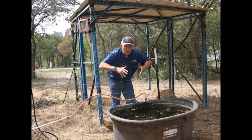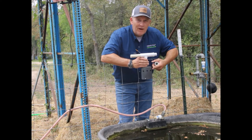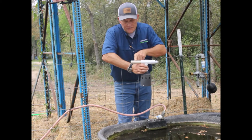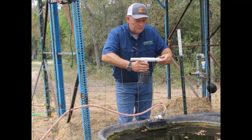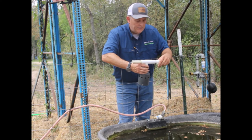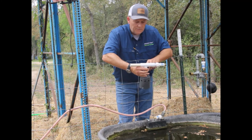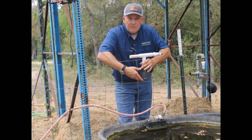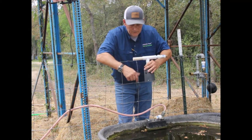That's the application for this type of float valve. Now, there are a couple other types of float valves as well. If you happen to have this type of float valve in your operation, get a PVC T and splice it in with your incoming water here, with a threaded end on this end, and screw your Freeze Miser onto this end. When the temperature of that water falls below 37 degrees, this is going to drip and keep your pipe and float from freezing, as well as your faucet up to 150 feet.